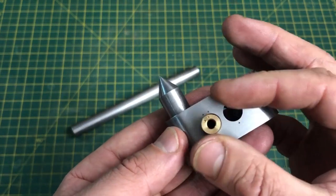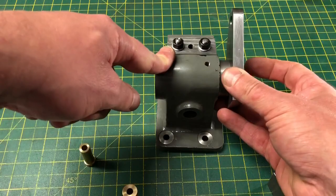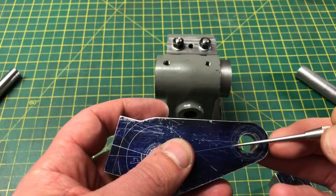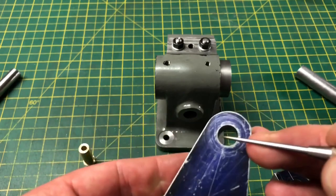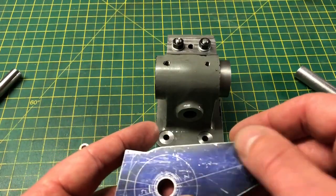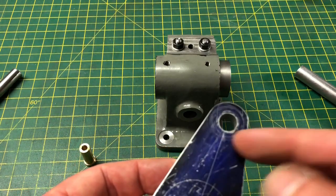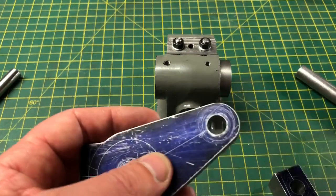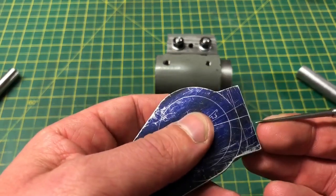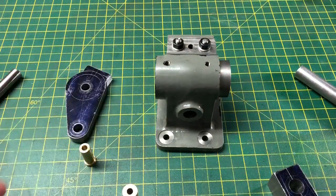The last component to finish is the banjo arm, which needs to be bored accurately so that it fits on the spigot here. There will need to be a pin hole somewhere around a sixteenth of an inch drilled here, as this hole is designed to take a circular-headed bolt. The underside of that bolt has a corresponding one-sixteenth pin, which will fit into the hole to prevent rotation when the nut is tightened on the other side. This will need a small jig machining to drill all of those holes at the same spacing, both in this part and on two different bolts. This will also need drilling through here, tapping and slotting, so that this can be tightened onto the spigot of the main casting. I will start with the main bore, which we will do over on the mill.